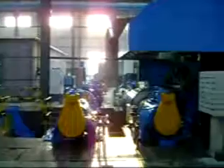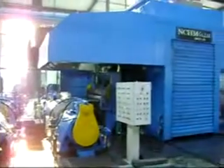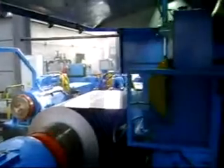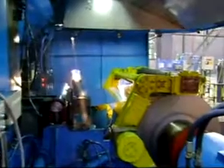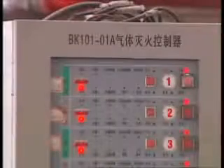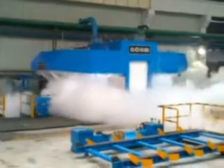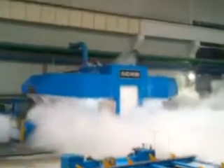During rolling, it is easy to catch fire due to the static electricity generated in the spray nozzles by the rolling oil and the great quantity of oil mist inside the mill. Therefore, the mill has a safe and reliable carbon dioxide fire extinguishing system to ensure the safe production of the foil mill.